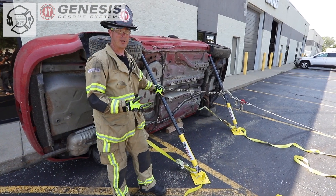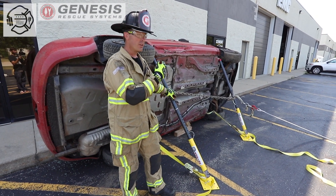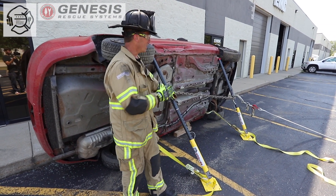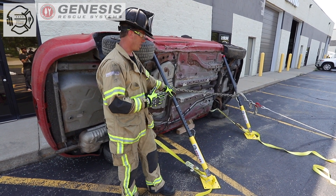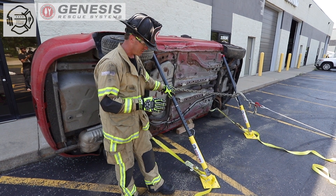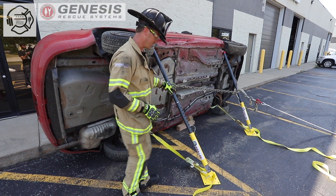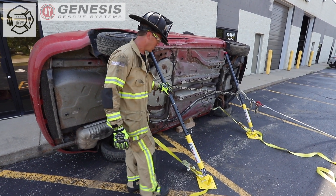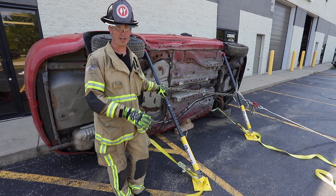So now the chain is tensioned down — it's not in contact with the struts — but the tension on that chain that runs from the front to the back of the underside of the car is putting weight and tension onto the tops of the strut heads, which makes the vehicle very, very secure. We never want to check for stability by shaking the vehicle itself; how we do that is to check for tension on the lower strap. It really ensures that you do have a capture at the base plate that's connected to the ground.